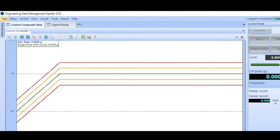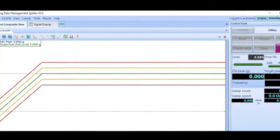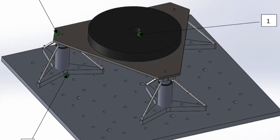To validate the damping properties of our two-stage design, we drafted detailed testing procedures. The main testing procedure runs a sine sweep to validate that the designed assembly meets the natural frequency and transmissibility requirements for both launch and orbit. An offsetting shaft accounts for the non-zero gravity environment of the shake table.